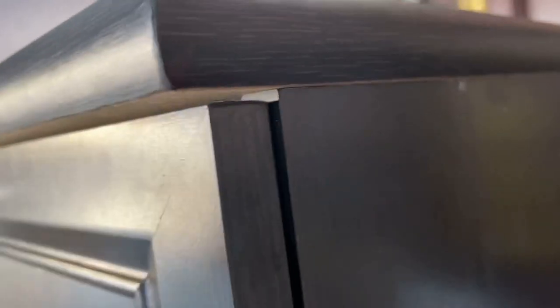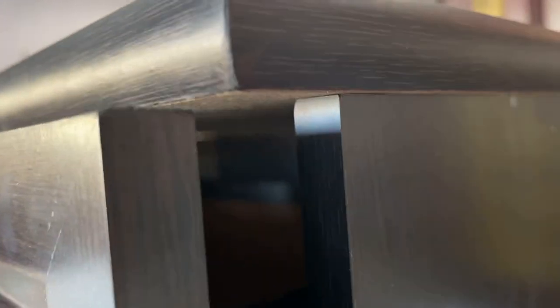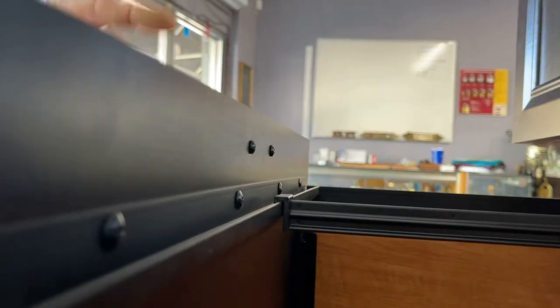How these are built really depends on what can be done with it. The main thing is you close the drawer — you need a surface for the cam tailpiece to go up into. You need to see how it sits. Some of them have an overhang when you close the drawer that would affect where you're able to put the lock on the face. This one does not have one, so it's going to be fairly easy. The second drawer does have a narrow little half-inch piece of wood that will affect placement.